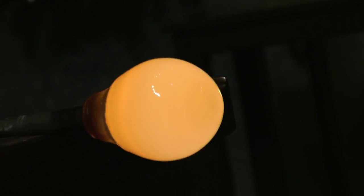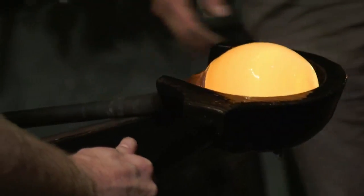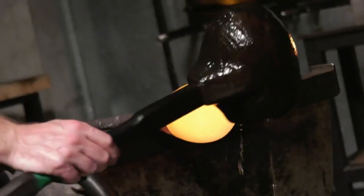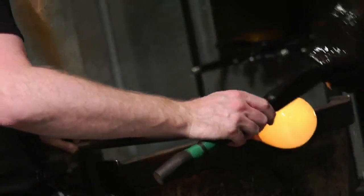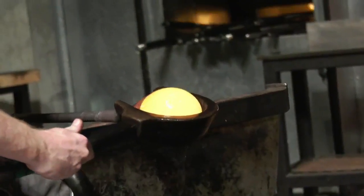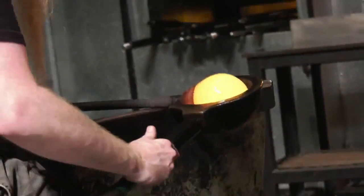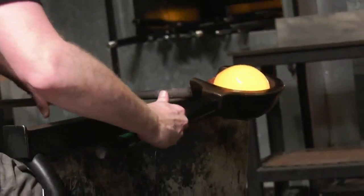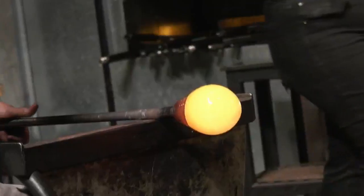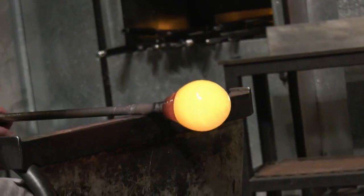Now, Cody went back to the furnace and took an additional layer. And remember, our furnace holds approximately 1,000 pounds of glass. Later on, I'll dive right back deep into that furnace. But this time around, I do want to talk about the steps and the procedures we take after the gather. We use a wooden block, and here at the museum, we love burning fruit wood specifically. Now, this fruit wood does have more of a moisture content, which allows it to be used for a longer period of time, and it just lasts longer than any type of wood. But an added bonus is that when we do burn it, it smells like a barbecue, which is always a pleasant smell here.